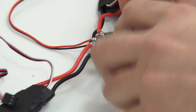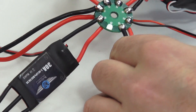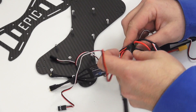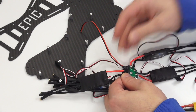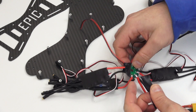You will also notice two small thin wires. I'm using these as extra power supply cables to go up inside the quadcopter to power any video transmitters that I'm going to use. Because carbon fibre conducts electricity, you will want to cover over this power distribution board. You can do this simply by using some tape like I did, or you can use some hot glue or liquid tape — it doesn't matter.